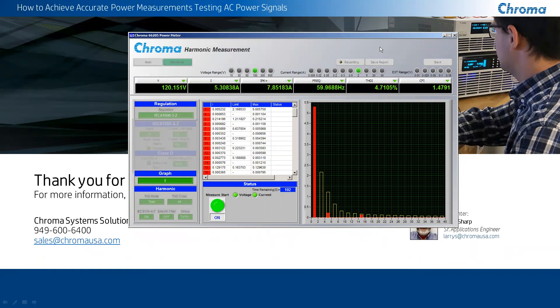I can change any one of these display measurements. For example, if I want to take wattage and measure the reactive power of this device — reactive power is very low on this unit because it's pretty much a resistive load. I can change to total harmonic distortion and current. Any one of these six displays up here can be reconfigured for any one of the types of measurements — including peak readings, ampere hour readings, and much more. They did a great job on our soft panel, and it's something that a lot of customers use as a great benchtop test software package.